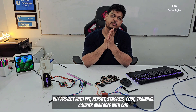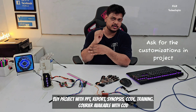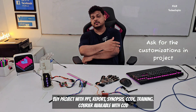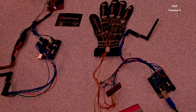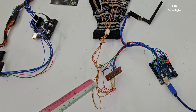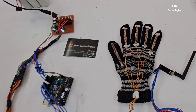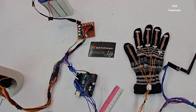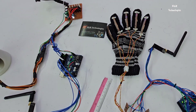If you need some customization in the project — like adding different types of sensors, such as a muscle sensor — you can add those to this project. We have an Arduino microcontroller here, and a voltage divider circuit connected with these flex sensors. When the flex sensors are moved, they generate some voltage on the divider.